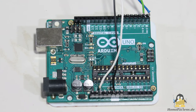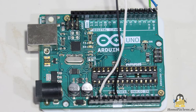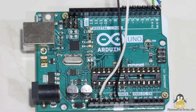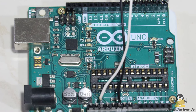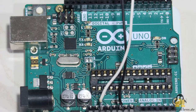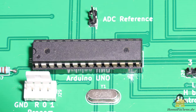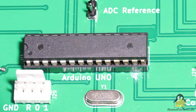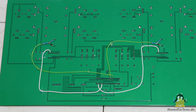Another change addresses the control pins of the transistors. Since not all microcontroller pins have hardware PWM support, I swapped two of these output pins, which makes programming much easier. I had to cut through the tracks on the circuit board and reconnect the pins on the bottom side with two more wires.